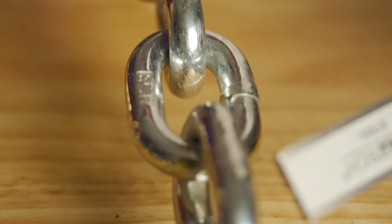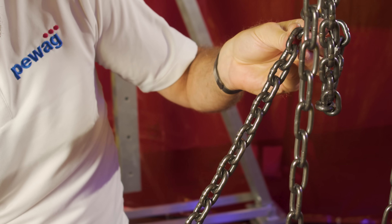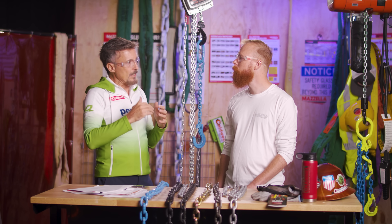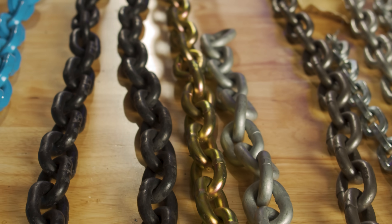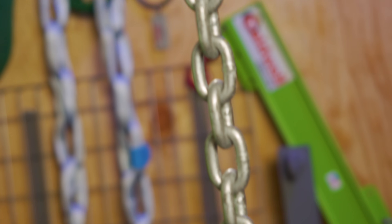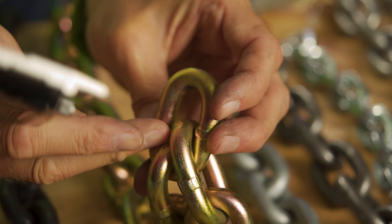The finishing goes a little beyond the aesthetic. To protect chain against rusting, there are different layers of coating. The very basic is dipping the chain in oil, which eventually evaporates and the chain rusts relatively fast. Then the first layer of coating is spray paint, then epoxy painting, then variations where you substitute the plastic with zinc flakes — a relatively good coating used even in the military. A step up would be electroplating, then hot-dip galvanized. Some are powder coated, but powder coating is less protective than zinc flake technology, and all are below electroplating and hot-dip galvanized.